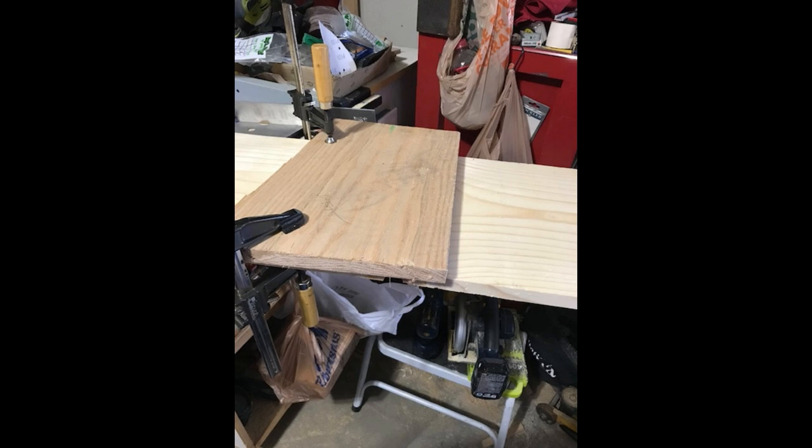I put a board on the bottom since the chest sitting on the floor causes that bottom board to bow and makes the bottom drawer a bit too tight to open. And then I put one on the top that's wide enough to spread the weight of the TV to the sides rather than sitting on the top board of the chest of drawers, which was sagging and making the top drawer hard to open.